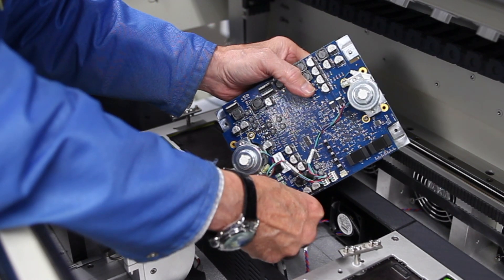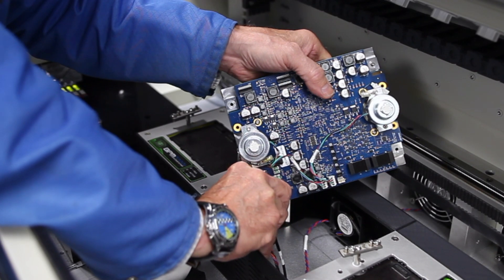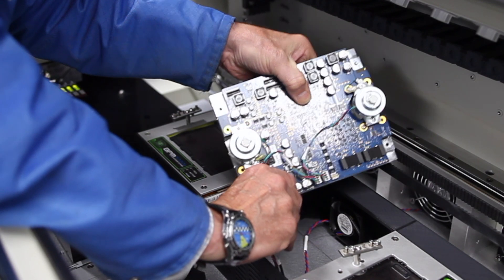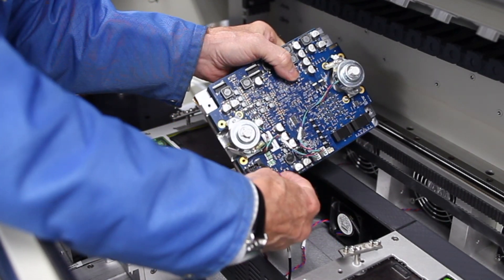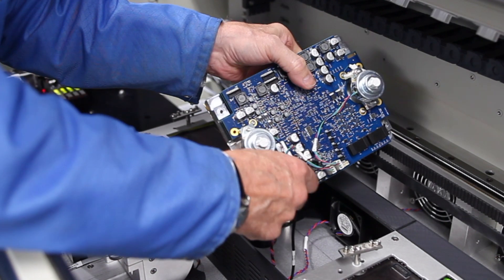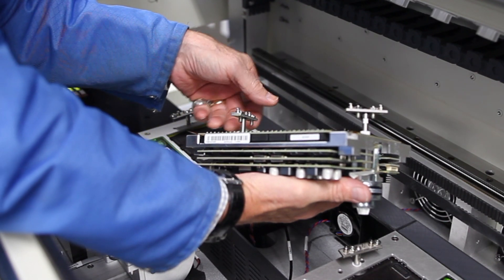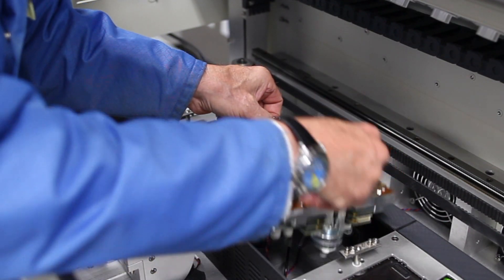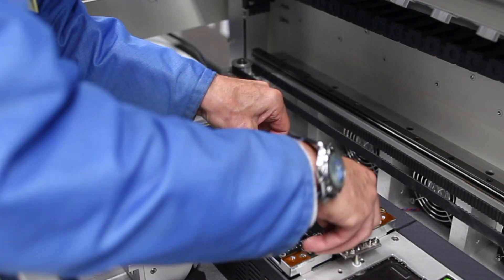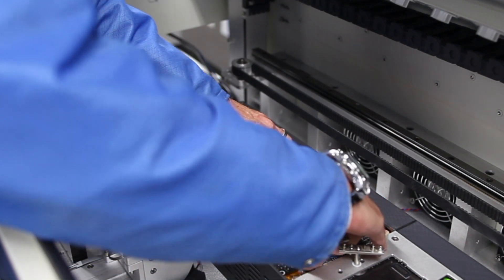We will install the micro USB connector on the edge of the board — you'll feel that kind of snap into place. Then take the power connector; it goes only one way. Snap that into place and make sure it's good and snug. We'll flip the site back over, set it back in nice and gentle, straight down. Might have to wiggle it just a little bit — there we go, straight on in.